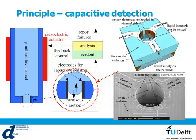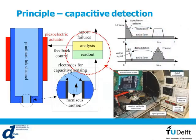The capacitance when the sensor was empty is about 1 to 2 picofarads, and when it is full with water, for example, in this case, then the capacitance goes up to 15 picofarads. So of course, for such low capacitance, you have a very, very small signal. So the signal-to-noise ratio is quite low usually, especially as we need to measure this signal at a frequency of a few tens of kilohertz, so you can actually get lots of noise in this bandwidth.